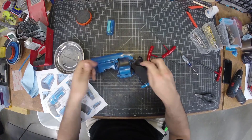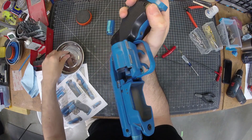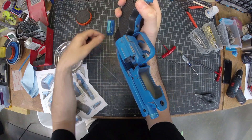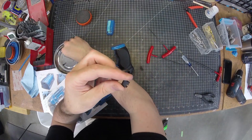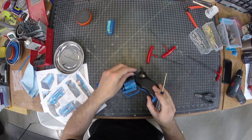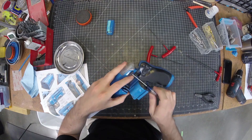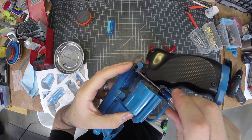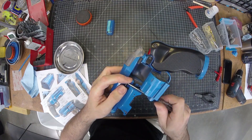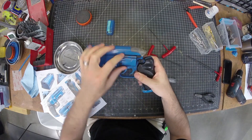Finally, there are these two tiny little bits here and really tiny little screw holes for a couple of M2 screws. Again, you really want to pre-thread those with the screw, not a tap. Then these bits — where the screw goes — you may have to go in with a Dremel to make sure the screw head can fit right in there. Then this gets screwed in through the bottom so you can't really see it. Hopefully these guys line up with that guy just like so.